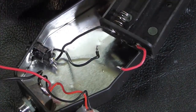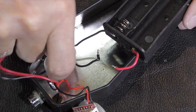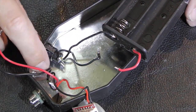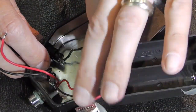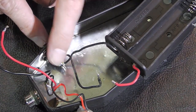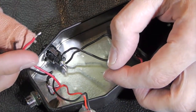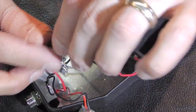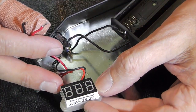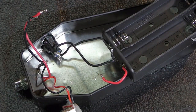So what am I going to test before we start piecing this thing back together? The way that we used to rig these things up is I normally take the negative terminal via a switch, so feed that in through the switch and back out to the board. So effectively the negative portion is switching the board on and off. The two bits I had up here were the output terminals, and those are simply going up to the atomizer connection. In this case, it's an ego, and they're also twisted together with a voltage board. Nice and simple.